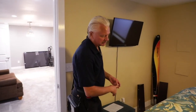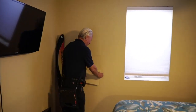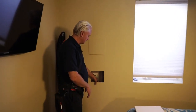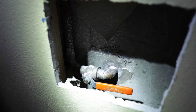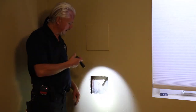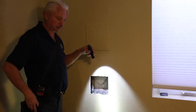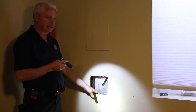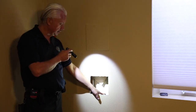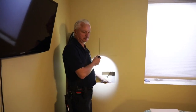We're going to start section 3.6, the plumbing portion of the inspection. The standards tell us to start at the main water shutoff. We are required, if accessible, to state what the main line is and where the shutoff is. This is a three-quarter inch copper main line. The shutoff valve is in the basement bedroom — that's what my report would say. We actually take a picture of it; that is the only picture in the report that does not relate to a defect. If we have a newer house using a cold water ground, we will typically see a ground wire here.